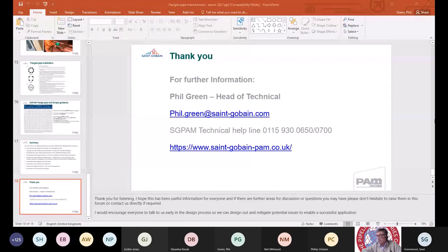If you wanted, for example, if you're connecting a ductile iron flange pipe to a polyethylene pipe, forces there are potentially more than the standard. So it's important to understand the limitations of products, and possibly communication is the key into getting a product that actually will suit the needs of the project. So yeah, absolutely fascinating. We're roughly two thirds of the way through our journey now in the world of flange pipes. We've covered design and all the things that a designer needs to know. We've covered manufacturer. The two are very closely related, and communication between those two parties is absolutely vital.